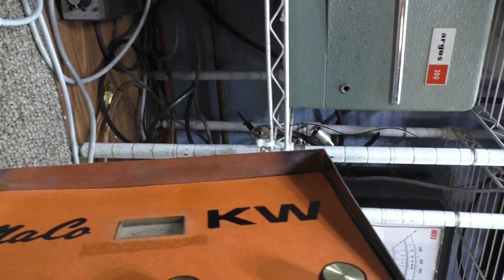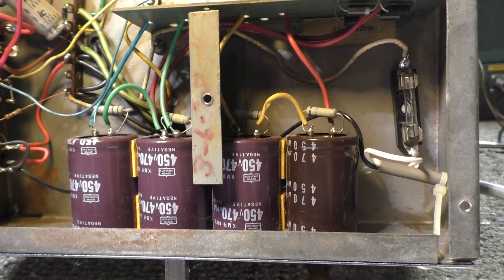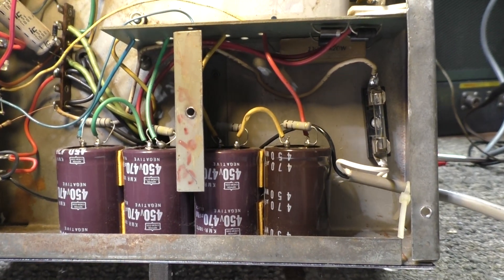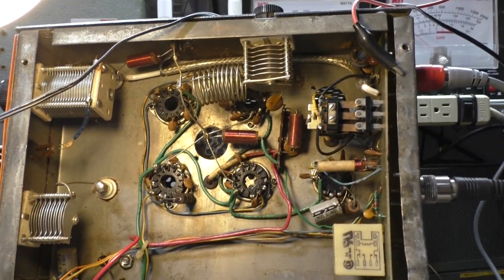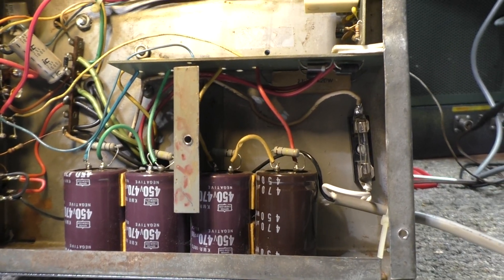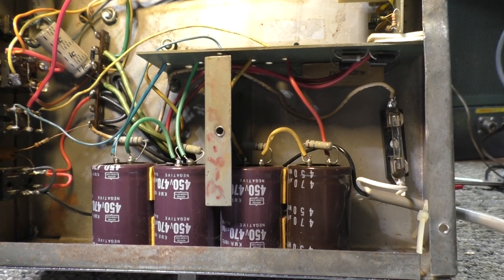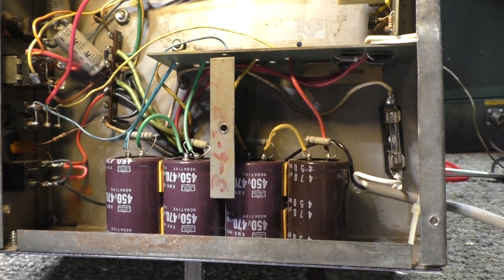I'm sure that's why I got this thing for a song and a dance — they pulled the tubes and could never get it right. I don't know why they were trying to do that. Were they trying to get more power out of this Mako 300? When it comes to transformers, if you've got a 500-watt transformer, there is nothing you can do to get more than 500 watts out of it. You can double the voltage and you're going to lose half the current. There's nothing you can do to get more watts than the thing is designed for. It's almost the same with a tube, but a tube you can push harder and get more — though the more you push it, the less it's going to last. It's Ohm's Law — it's mathematically factual and there's nothing anybody can do to create more power out of something not designed for it.